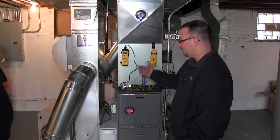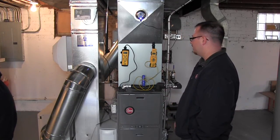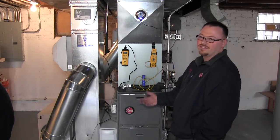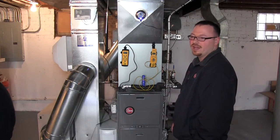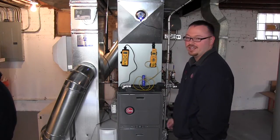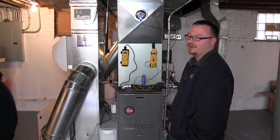That's why with our high airflow we're only about 25 degrees of temperature rise. A typical 95% gas furnace temp rise could be, depending on your blower setting, anywhere from about 35 degrees on a low up to 65 degrees on a really high temp rise. So a little cooler discharge temp, but no matter what temperature you want to keep your ambient air in the house, it's going to match that no problem.